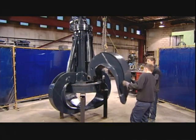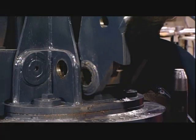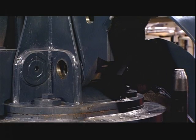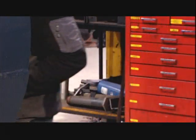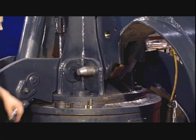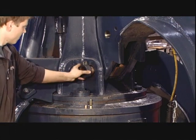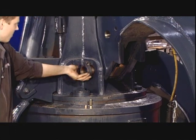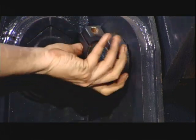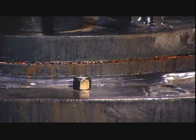They guide each steel finger into slots in the grapple core and align them correctly. They slide a pivot pin into the attachment holes to link the two — this pin also acts as a kind of hinge as the finger opens and closes. They fasten the pivot pin to the grapple with a nut that's split in one spot, enabling it to be squeezed tightly around the large pin with a small bolt.